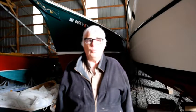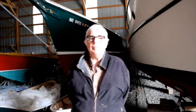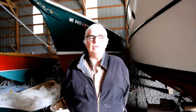Today I'm back over at Tortuga, my 1936 wooden powerboat, and I'm going to start prepping the hull for the new plank ends that are going to go in. Yesterday I came over and used my wood chisel to remove a little bit of rot from the stem underneath the planking and then filled the gap — which wasn't very big, less than an eighth of an inch — with thickened epoxy rather than putting in a graving piece. I'll show you that in a little bit.